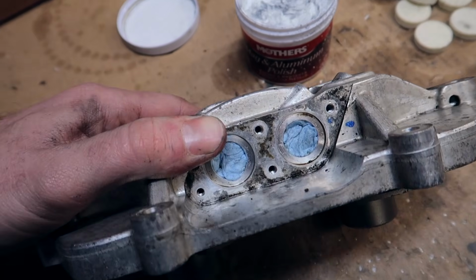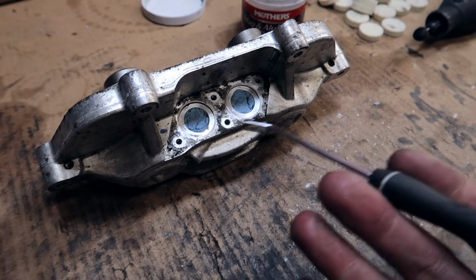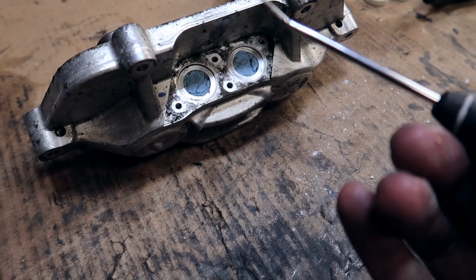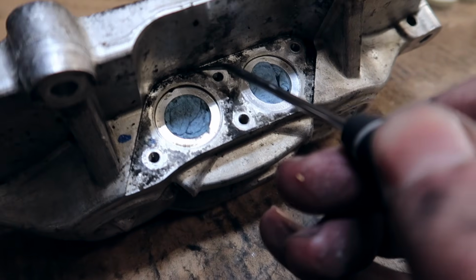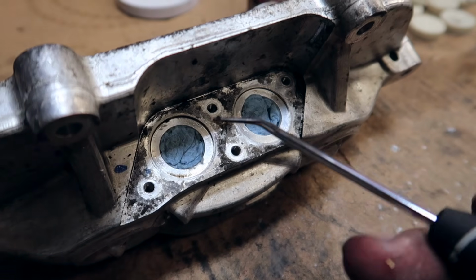First off, you want to plug up every port, every hole that we're going to have something going through. So where the solenoids are going to be sitting, you want to plug it up completely, remove all the O-rings, clean it up. What I found useful while doing the first one is you could take a little needle like this, just kind of scrape off all those corners where there's a bunch of gunk stuck, get all the big pieces that are just stuck onto the aluminum off.